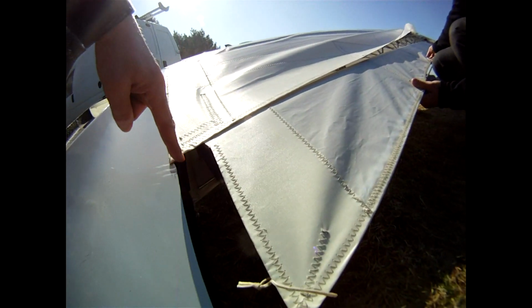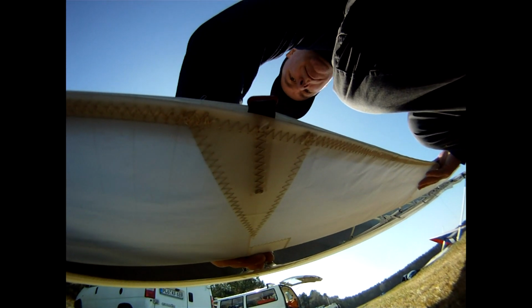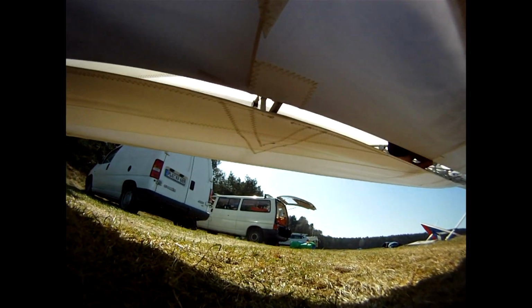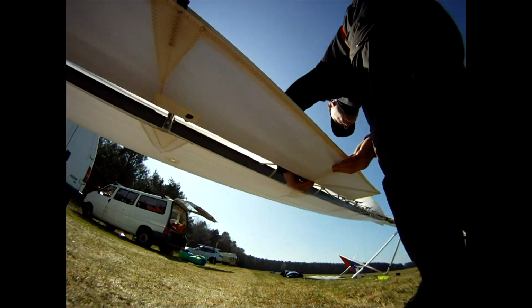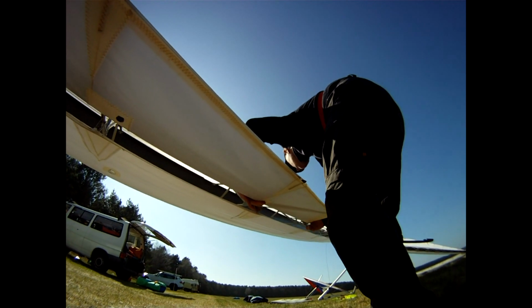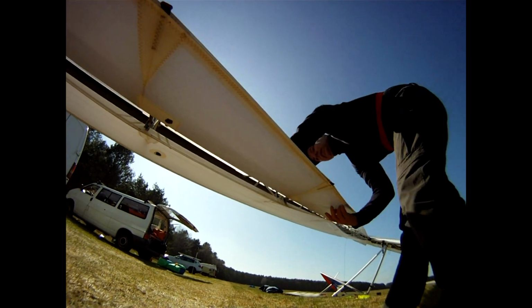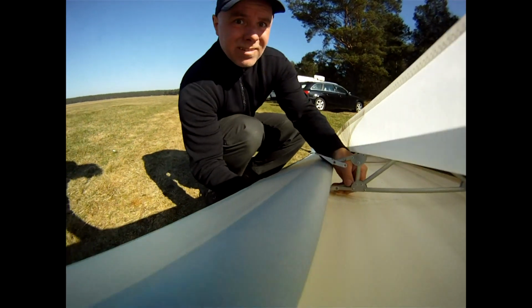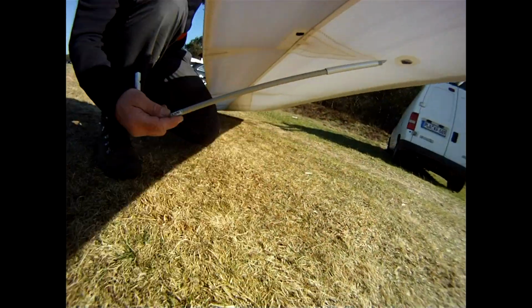At the end of the beam of the aileron is a small axle, and the bearing for this axle is inside the end cap. And now I have to fill in the bearings of the aileron into the end of the rib. At the other end of the beam of the aileron there is axle 2, and this axle finds its place on a special fitting at the end of the rib. Here you can see how I close the tightener or the tensioner of the rib.